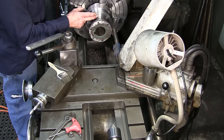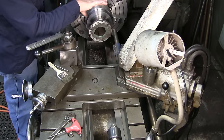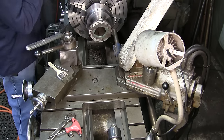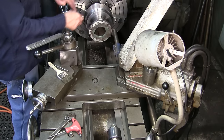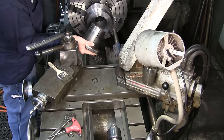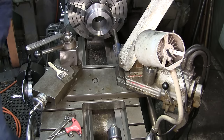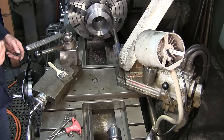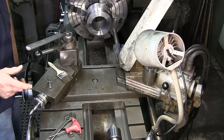We're planning out what diameter we're going to create here, because this is going to get a couple of weld beads — two weld beads on the outside, two weld beads on the inside. That's going to shrink this whole thing uniformly, so we're just looking at that whole picture.